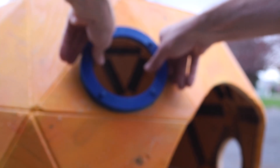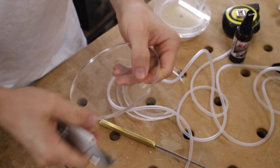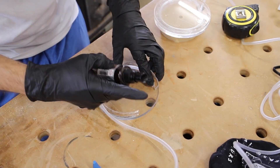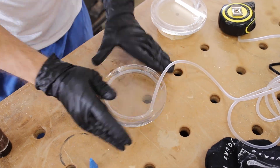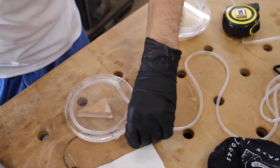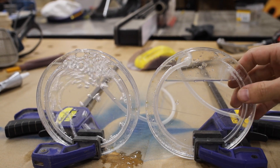To make this a true SpongeBob SquarePants pineapple house, the key element is that he lives under the sea. Making the windows look like they're underwater would be a unique effect for both humans, canines, and sponges. After CNCing a six-inch circular window frame, Gavin had some old thick acrylic that would really bring this effect to life. You have to cut a thin inner frame, which is then glued in place — make sure to use plenty of glue because it has to be watertight. I'm taking an air tube from an oxygen pump used in a standard fish tank and gluing it along that inside edge. It helps to have large holes already puncturing the tube to create large bubbles — it's a balancing act of enough holes but not too many, otherwise the pressure is reduced too much. Putting a plug at the end of the tube forces the air to go where you want it, which I found out the hard way after everything was glued and sandwiched together. Eventually fitting a little cap at the end gave the windows the illusion that things were underwater.